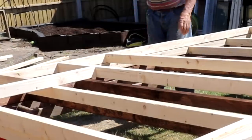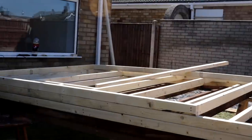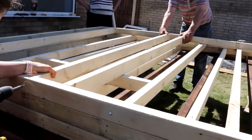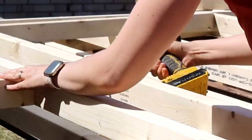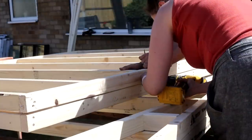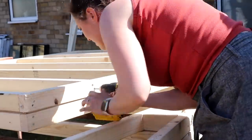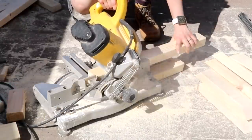Next, we needed to work on the sides. I'm stacking and building as I go, but this time it's around half of the front and back's width, ensuring it matches what's left of our base. We're planning around another small window and a gate-style door for access, which we'll make later. Then finally, to make the last side with no access and some easy straightforward spars like we did for the back. My dad also asked me to make some more mitered corner braces using some offcuts, which I fitted into the corners again to keep things square.